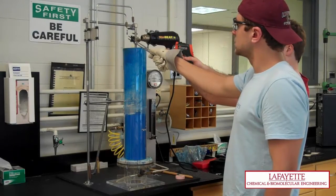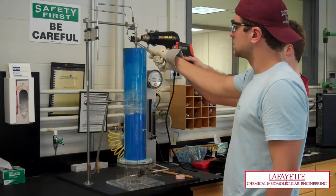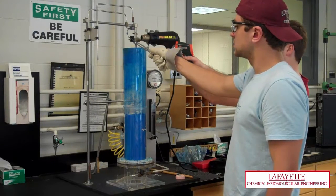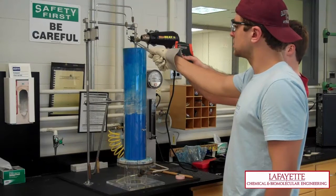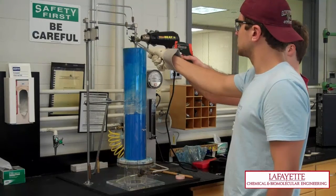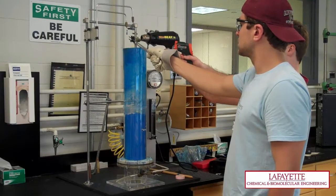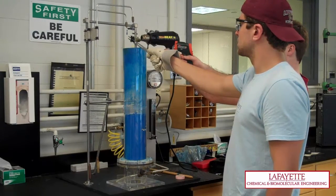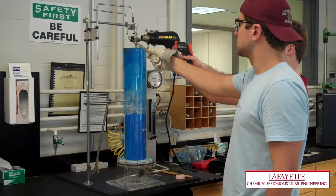When operating the heat gun, protective gloves must be worn to prevent burns. Make sure that the heat gun is directly pointed at the tag and that no one besides the operator is in the vicinity of the heat gun. Tags must be held steady while heating. To determine the temperature of the tag, turn the IR thermometer on by pulling the trigger and ensure that it is in EMS mode and that the emissivity value is set correctly.